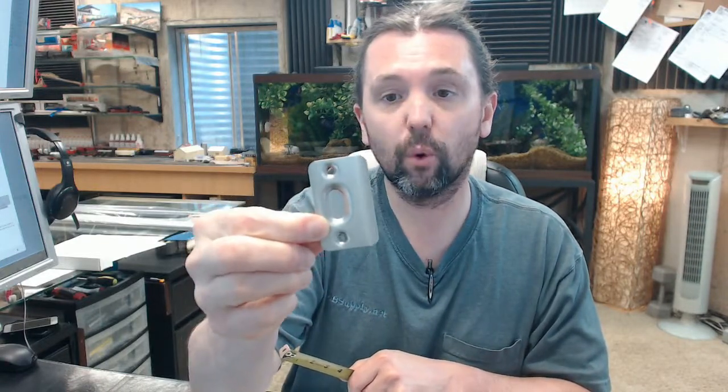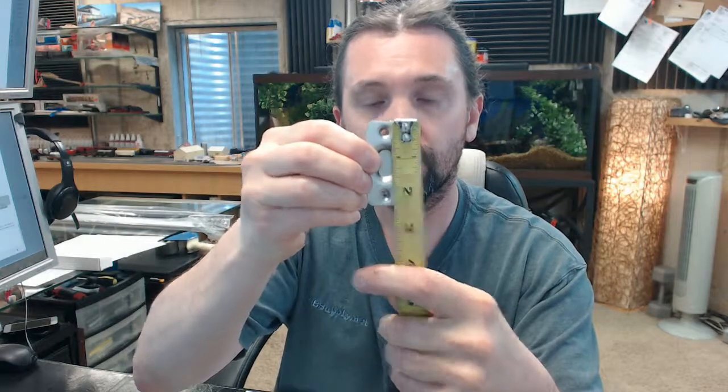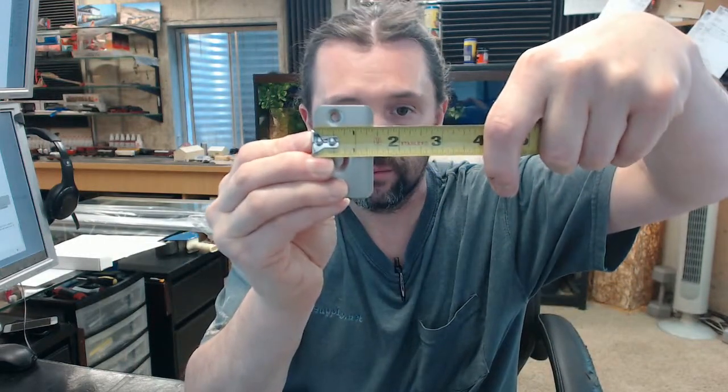You might have a closet door in a residential application where it's a single door, and you have a pull handle or a flush pull mortised into the door, and all you need is a ball catch. And the strike plate is part of that assembly. So again, it's 2 1/4 tall. The overall width is 1 7/16. Dimension from the center line of the screw holes to the edge is about 7/8 or 15/16. Screws are included in a complementary finish, a couple of flathead screws.